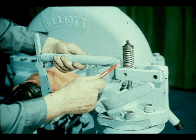The workman now raises the resetting lever very slowly, watching the spring very closely. The spring should begin to compress just before the resetting lever has been raised high enough to latch onto the hand trip lever. You should also feel additional resistance from the spring at this point. The resistance is caused by the shoulder on the top of the valve coming in contact with the upper valve seat in the cover. The seal created by the shoulder and the seat is designed to prevent steam from escaping between the valve stem and guide during operation of the turbine.